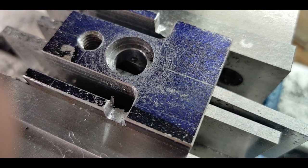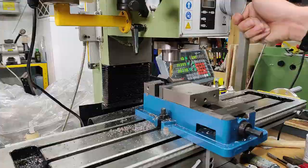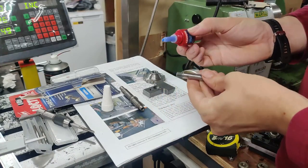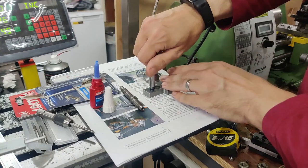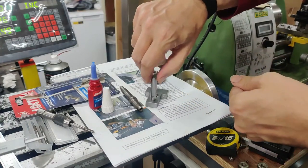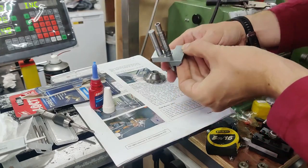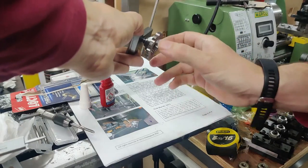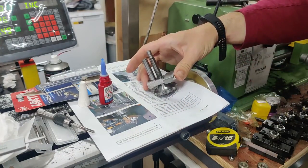Here I'm just milling out that T-slot shape for the jaw. You can see the marking outlines in the recessed part of the jaw, which is critical to the thread. Just chamfering off the back edge - I can laser cut some angle blocks to make 45-degree setups possible; the acrylic ones worked really well. And just Loctiting in place the main precision rod of the moving jaw - very satisfying fit. The great thing about machining when you do get it right is having these very precise fitting parts. You can see how the screw thread is captured in the moving jaw with the handle and that flared disc. I did Loctite this in place, but I ended up going back and putting in a grub screw just to hold it really tightly.